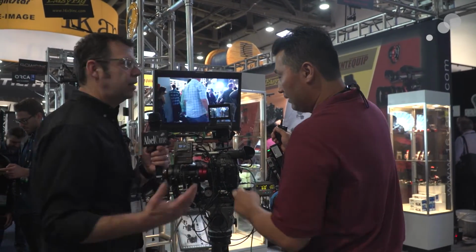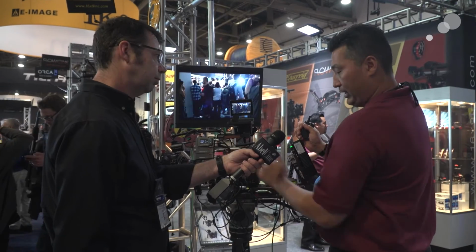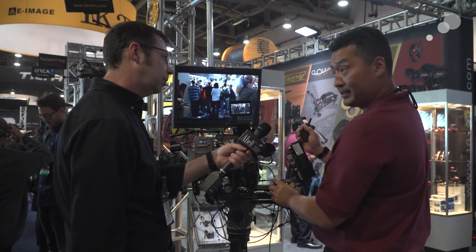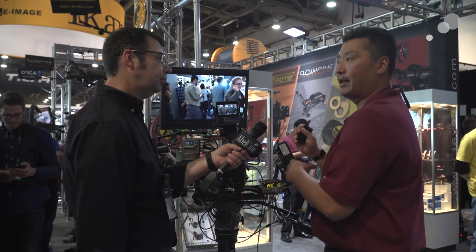Okay. Yeah, and what you're seeing also here is that the rangefinder is then connected via one communication cable, so they communicate with each other, so that's for the autofocus functionality. But if I was to detach the communication, just run this independent, and calibrate the focus motor, you can see the focus motor right now is plugged directly into the rangefinder. So then I can run that completely independent of the wireless system.